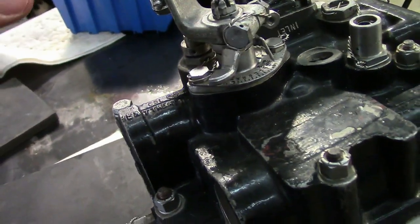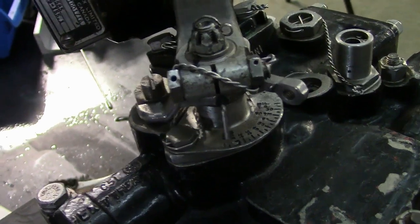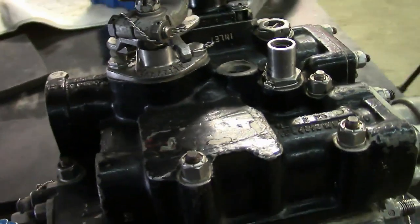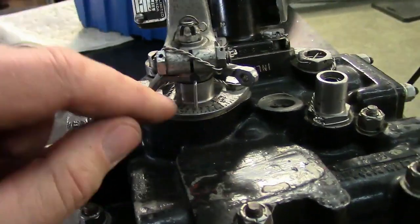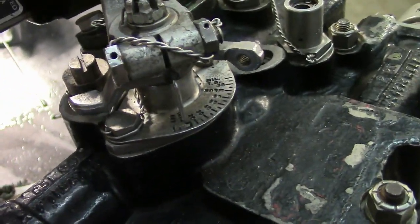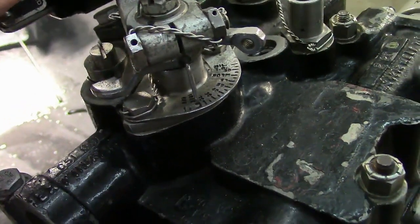This is the thing that feeds the engine the gas. There's a minimum stop — you can't go lower than off — and there's a max stop as well. The min-max of the fuel control is greater than the min-max needed by the engine. This is the power lever and that's the pointer indicator. Right there is idle, which is also starting — there's a little range box. That'll become important in a few minutes.